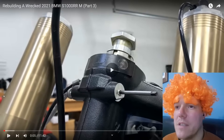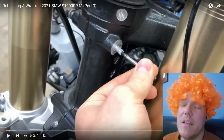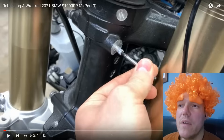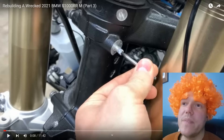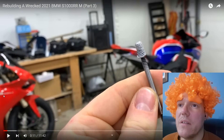Easy outs — it should come out easy, and you didn't really need them. You should have just got a left-handed drill bit, for the simple fact that it's just sheared off. The fastener takes the side load and that's it, there's no corrosion or anything so that should easily come out — although it might have left some debris in the thread.